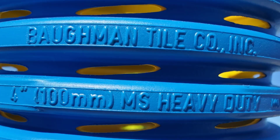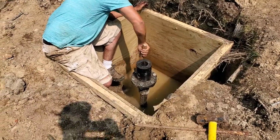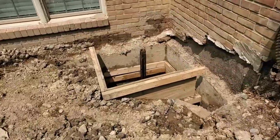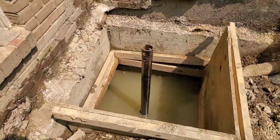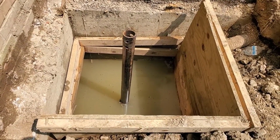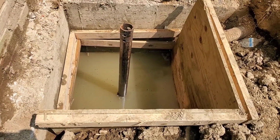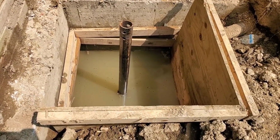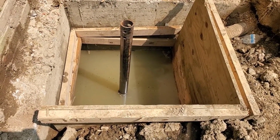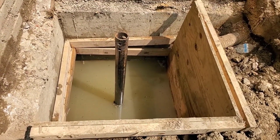A lot of subscribers are asking us, when you dig down and hit water and you keep pumping it out and the water table's that high, what do you do when it comes to putting in a foundation? The water keeps filling in these holes, and every time they're pumped out, it just returns quickly. The water table is that high. We are going to build a system to help relieve the water and hope to lower the water table. However, you do need to use helical piers in a case like this.